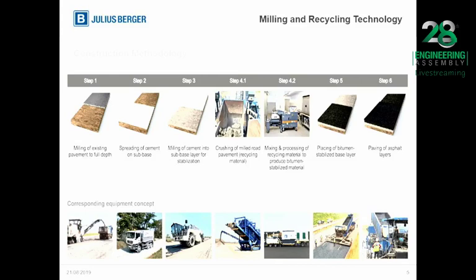This method affords the ability to remove the upper portion of the pavement, kept in a temporary stockpile. Then the base layer is stabilized using cement. The material kept in the temporary stockpile is then treated by addition of bitumen, cement, and water. The bitumen added is usually a foamed bitumen, formed using state-of-the-art technology at 175 degrees in a recycler chamber, where small amounts of water and air are added at high pressure, resulting in an expansion of the bitumen. This is then added to the reclaimed or milled asphalt in the recycler chamber.